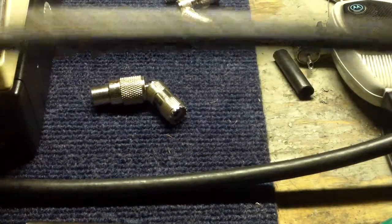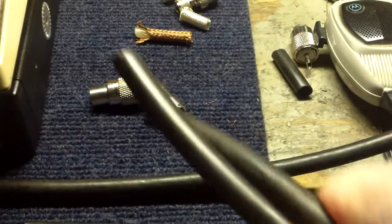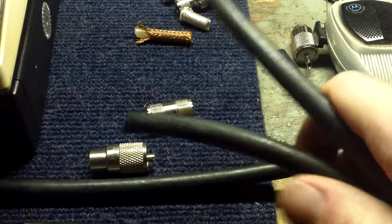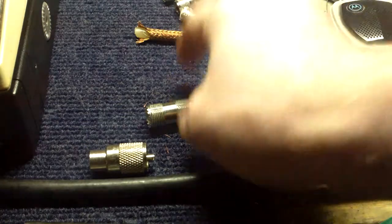One of the pieces I'm using as a jumper in its entirety — I will attach UHF connectors on either end. I have genuine mil-C-17D mil-spec RG-214 on both the transmit and receive side of the duplexers going to the actual repeater radio. Then I'll have that Comet diplexer hooked to the output of the duplexers. Hopefully I won't have to make a jumper for that, but if I do, I still have about eight feet of RG-214 C-17D left.